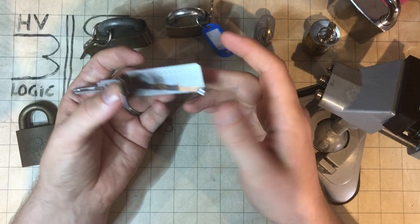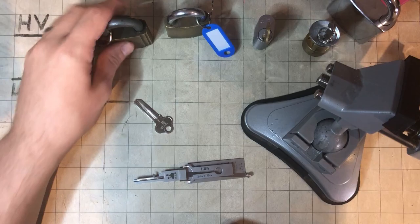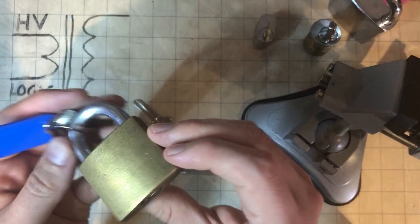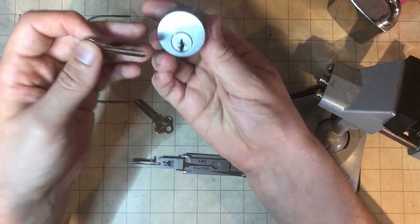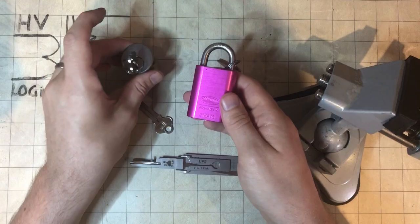So that's why I bought one — because I do come across quite a lot of older Lockwood padlocks that don't have any keys. While impressioning is certainly one way to make new keys, this is a nice alternative method to pick, decode, and then cut a key off that. So if I've got a stubborn lock that doesn't want an impression, or one I can't decode and doesn't want to pick, then you've got both options. So it's just an array of stuff I've been practicing with. I picked this one last night — it was a real pain with those Lockwood taper pins. Having a Lishi does not make picking taper pins any easier. They're still a nightmare. This one here is a nice Lockwood style — GM, I assume, for General Motors. I'm going to pick this carbine cylinder, which is one I make challenge locks out of. I've also picked this big Lockwood — that was a bit of a pain with the spools.